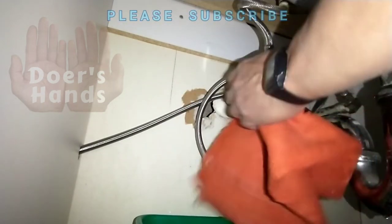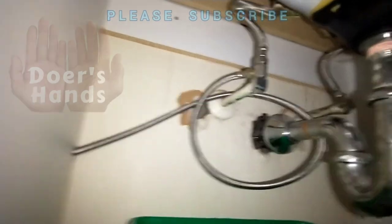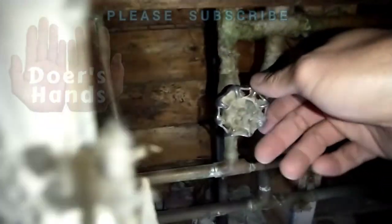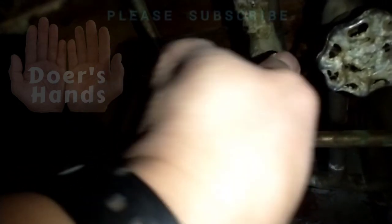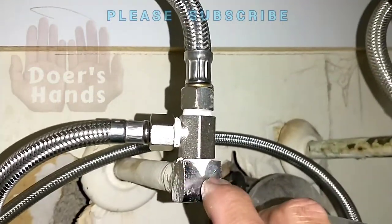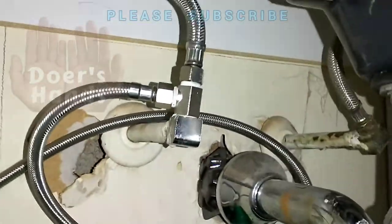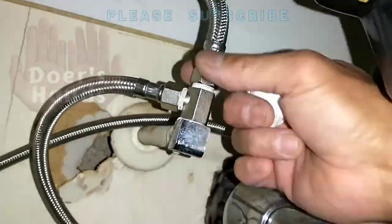Otherwise you will have a wet problem on the floor. It's all dry, but I have to turn on the valve again because the hot water line has a pressure that will prove if it's leaking or not. Now we will turn on the hot line. Close this access. Now I redo my fittings. I put Teflon tape. You see the excess Teflon tape outside. Also here, all three ends I put so that there will be no leak anymore because of the hot water. Somehow there's a pressure. Make sure it's all dry. No wetness anymore, so that's fine.